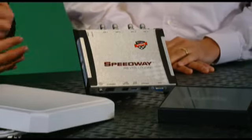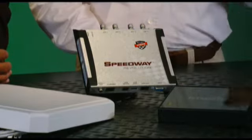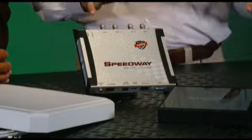Better receive sensitivity — the current Speedway has negative 80 dBm of receive sensitivity, and this improves upon that. We've improved a couple dB on this new reader. We also have a new set of features we call Autopilot — a set of features that constantly monitors the environment and optimizes the RFID settings for the particular environment. It uses auto-set, low-duty cycle, dynamic antenna switching, and improved inventory algorithms to achieve this.